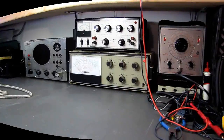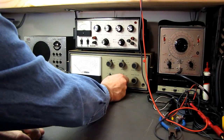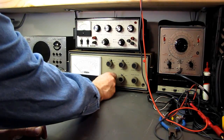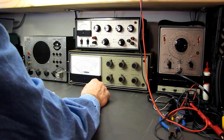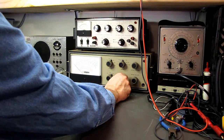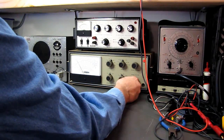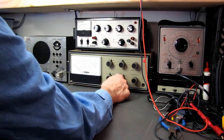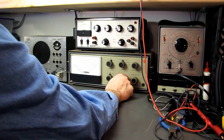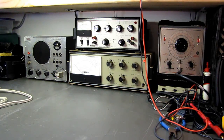Our meter is back in position and fully functional. We're on the line position, the needle is on zero. I switch between plus and minus DC volts and everything is fine. If I switch to battery, there's probably going to be a shift because of the voltage differential, but I should be able to zero that right out. These meters are not $1,000 meters — they're very simple but very accurate, and they work well.